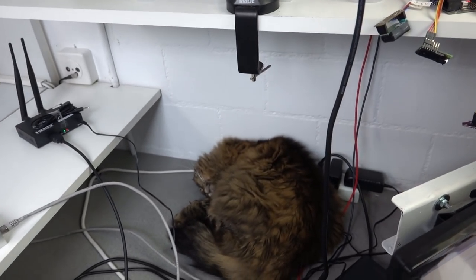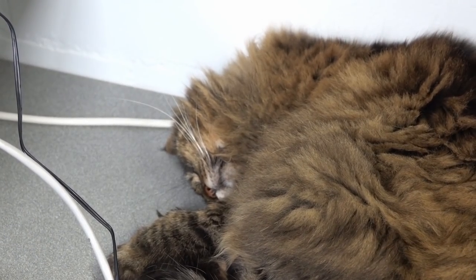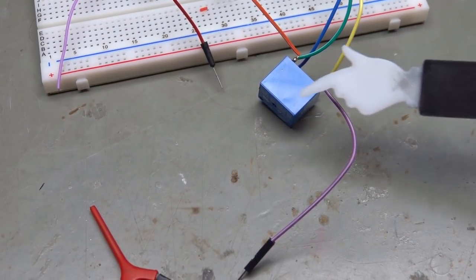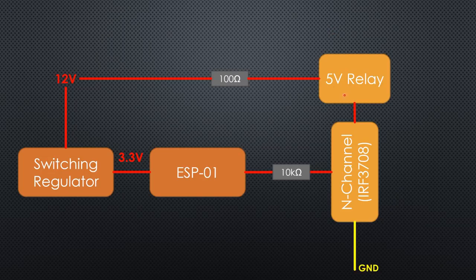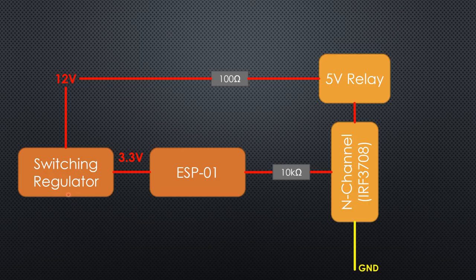By the way, if you hear snoring in the background, it comes from my lab cat Dishka — I did not want to wake her up just for my recording. Back to the project: I decided to use a 5V relay instead of a switch or a wire to connect the two pins. Like that, I can switch the whole beast with a tiny ESP01. This relay consumes around 70mA, and therefore I need an N-channel FET to switch it. Because I use the 12V standby voltage, I insert a resistor which drops the voltage from 12V to 5V at the 70mA used by the relay. Then I connect the gate via a protection resistor to GPIO2. For convenience, I added an LED to the same pin, and I added a switching regulator for 3.3V.